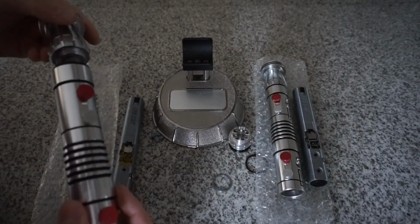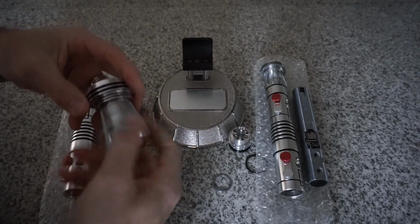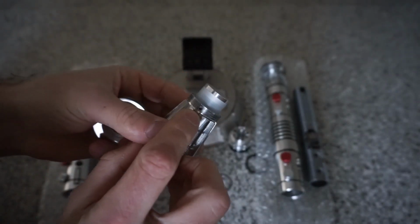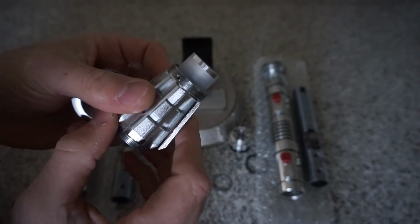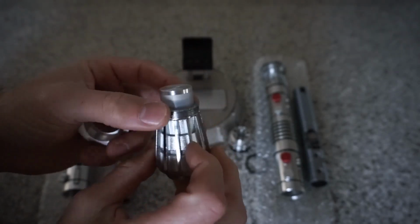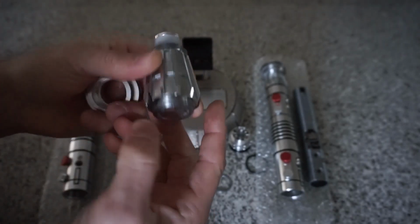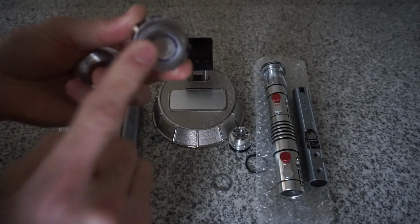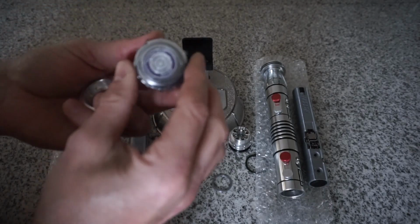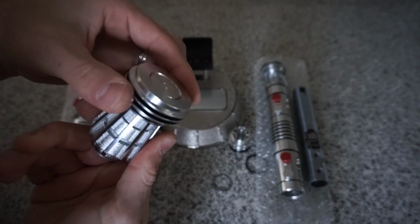So assembling, let's take a look here. So we have a blade plug, which is being held by blade retention screws that have been drilled and tapped. I'm thinking 6/32. I forget what I did there. Probably not 4-40, probably 6/32. And I do 2, just to make sure that it's perfectly centered, so you get a nice red ring around. And I'll show that when I put it back together. And it's also flush down here, so that it makes contact with the PCB when it's in the hilt.